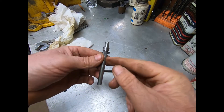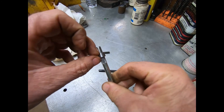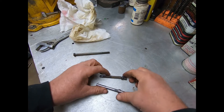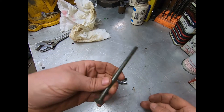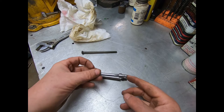I put a little bit of heat to it with a torch to cure it — not a lot, just bring it up to a couple hundred degrees and it will cure within 10-15 minutes versus waiting 24 hours. The end result is a perfect replacement pin that cost you one bolt, a piece of scrap steel, and about a nickel's worth of Loctite.